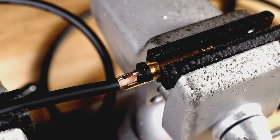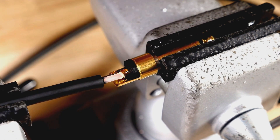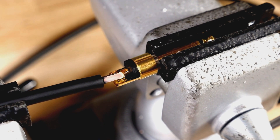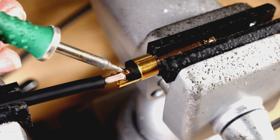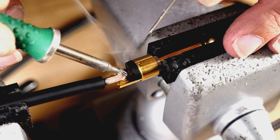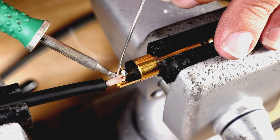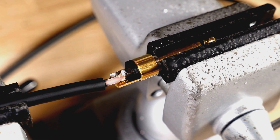I have prepped and pinned the cable on the other end and once again secured the cable in one vise with the silent insert on the other. I have preset the center wire into the tip pin and have the shield below. Take your soldering iron and place it on the center pin for approximately two seconds and then add some solder. Repeat this step for the shield and then you're done.